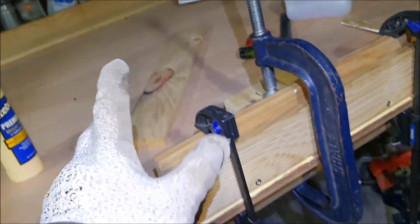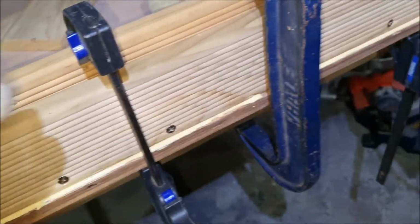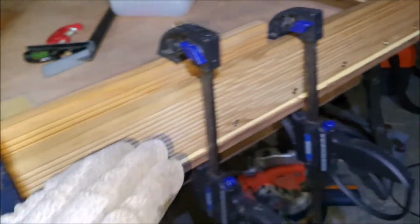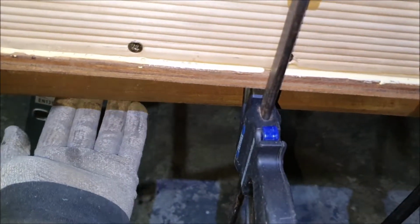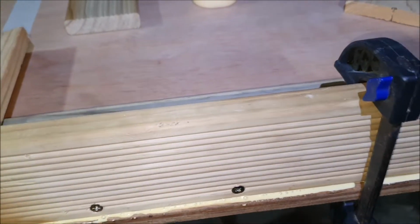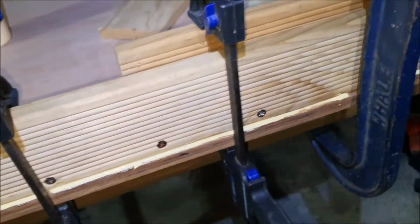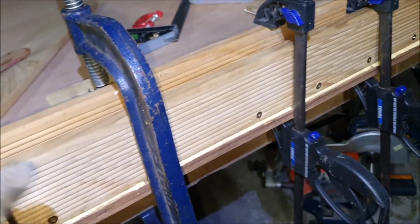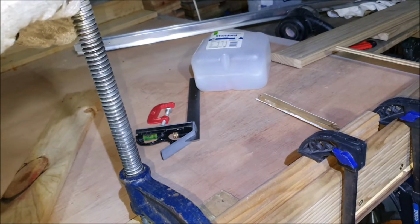So that was tricksy. What happened is I got the sides mixed up in my head, because this is the inside part. I'm gluing this on the inside. So again, when I had the door handle, if you can remember, it was bending over this way. So now I've got this beam underneath with this handle, a little bit of spacers, so it's pushing, and instead of being bent this way, it straightens it out. I did bend it about 2-3 mils, so there's a bulge about 2-3 mils here. Maybe add one more.